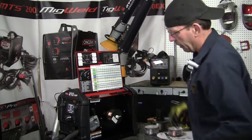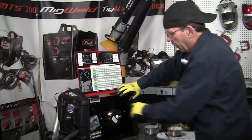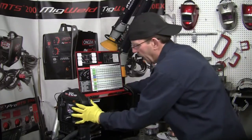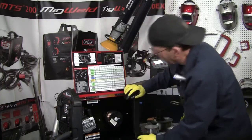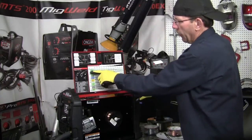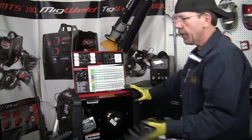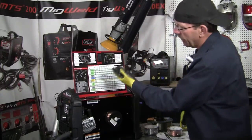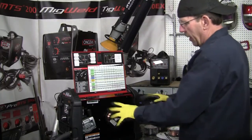It's really self-explanatory when you're looking at it — it's the same mechanism as a standard MIG. Make sure the wire comes across the top, not underneath. There's a switch inside here that'll set it for the spool gun or for your standard gun. Up here you've got a chart that explains the types of material you're going to be welding, the voltage you want to use, the wire speed, and all that. It even has diagrams up here, which I like. It's just a copy of what you'll get in your owner's manual anyway.